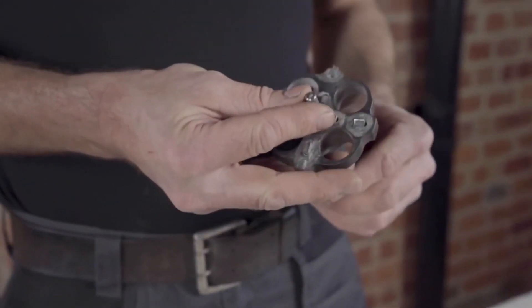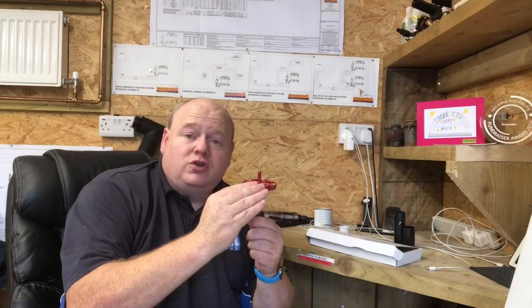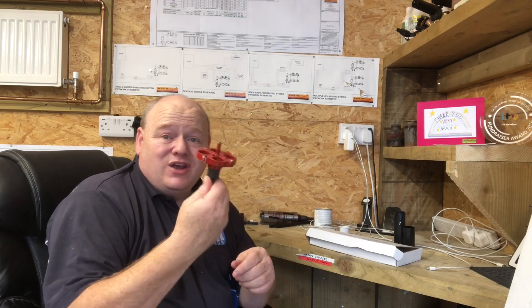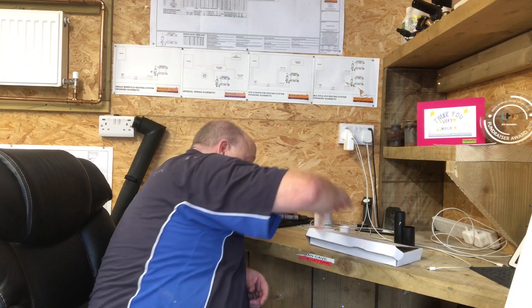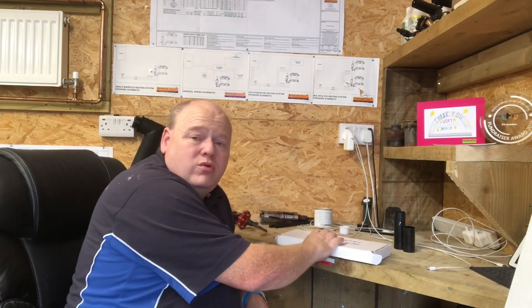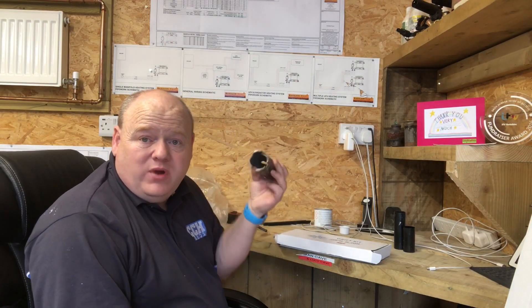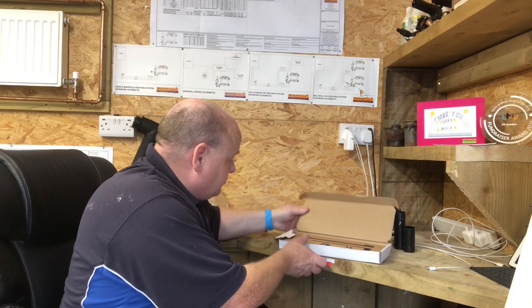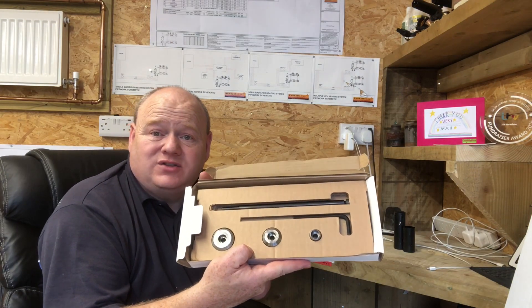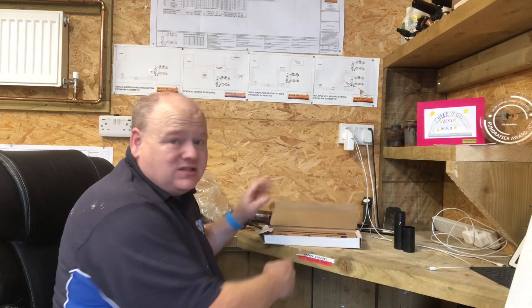David Smith has really thought about this to make it easy. The grinder head - if you've got stone you can make it flat so your pipe snug fits properly. Another thing they've designed is the drift kit - if you've got an old overflow pipe sticking out and need to core it with your core drill, it's got different connections so you can core it more easily. Really good design.